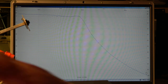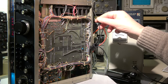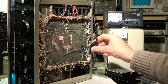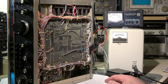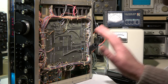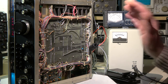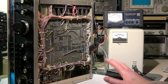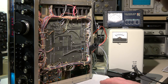I will resolder it now with this cable and see what happens. The PA brick is in place. I replaced the original wire with a new one and also added — just for test purposes — a ferrite core. It didn't improve the situation. Maybe somewhat more or less output, but I cannot measure it very precisely. The problem is still not solved, so I assume we have a problem — maybe a feedback into the driver stage or something else. I have to think about it. For now I will stop this topic, take a break, and maybe open a bottle of wisdom.